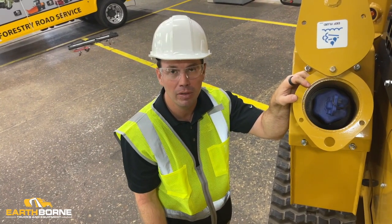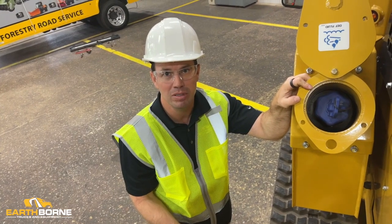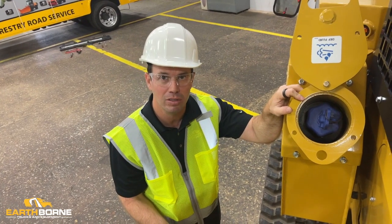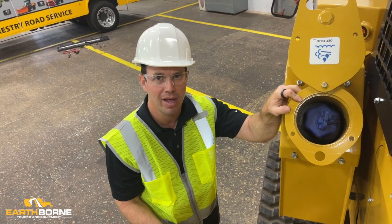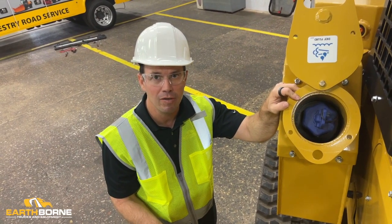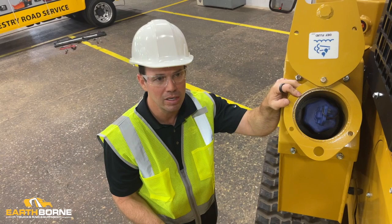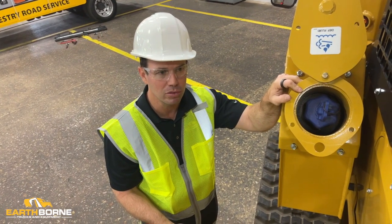A couple other things is make sure that the DEF that you're buying hasn't been sitting around for a while. If you go and buy DEF, buy it from a place that normally sells a lot of DEF, so it's constantly turning. It's not just sitting on the shelf for months, because DEF has a limited shelf life. You want to make sure that when you're storing the DEF, you're not storing it in the hot sun, you're not leaving it in the cab of your hot truck. You need to be really careful with the DEF so that you don't have any issues with your machine.